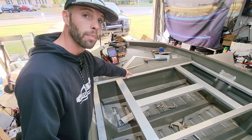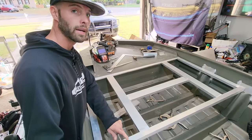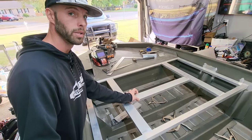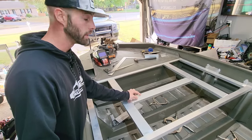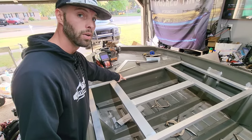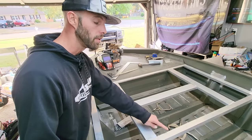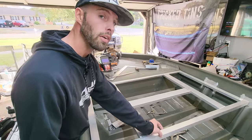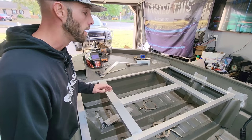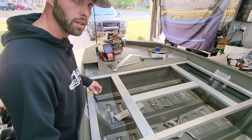This is my 1.5x1/8 inch aluminum angle. I use this on the front and on the back side because the hatch frame is 1.5 inches. So with this 3-inch tube in the center, the hatch frame meets perfectly, and it will also meet perfectly with my front deck. I did install this piece of angle 1/8 inch low just so it can receive the hatch frame. Same thing over here, this one will run out flush and it will be even with the drop down portion to his floor. Now I am going to come back and put a couple of support braces in between here on either side.